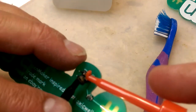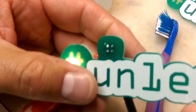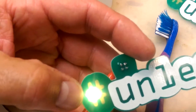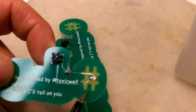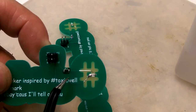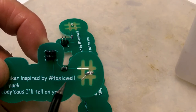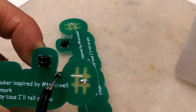Well, 20 volts, 220 ohms — yeah, that's dissipating a fair amount of heat. In any event, we created a brand new smell. But five volts doesn't take much current to light it up. So those LEDs from the meetup are pretty skookum — they'll tolerate 20 volts quite nicely. But your dropper resistor needs to handle it. At 20 volts, 100 milliamps was driving it this bright, and the LED didn't get hot, but the dropper resistor certainly did.